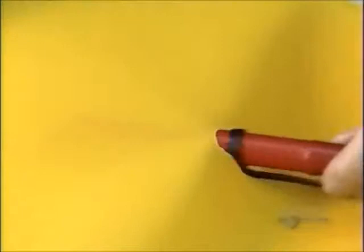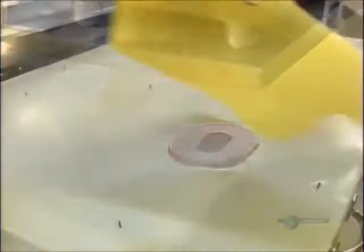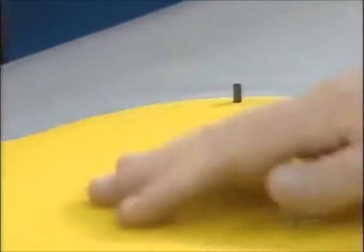Next, they pull an oral inflation tube through a pre-cut hole, and then place the assembly under a radio-frequency press. It emits energy that heat seals the tube to the fabric. They fasten the back and front vest pieces on pegs to align them. She slides the table with the vest pieces under a big radio-frequency press, and again electromagnetic energy bonds the plastic pieces.